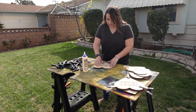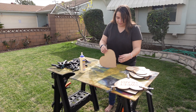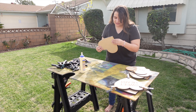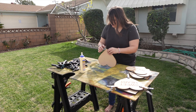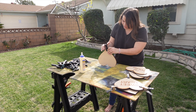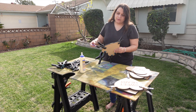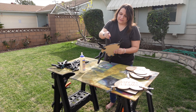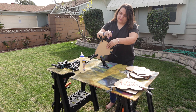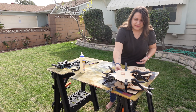If you find that your pieces are sliding around way too much with wood glue, you can sprinkle a little bit of salt in between the two layers and that will prevent them from sliding around as much. I just got this bag of cheap clamps at Home Depot. This one wants to slide around a whole lot, so with this squeezer I am just going to spread it out. It's not perfect — it does definitely want to slide — so just keep that in mind when you're doing this project.